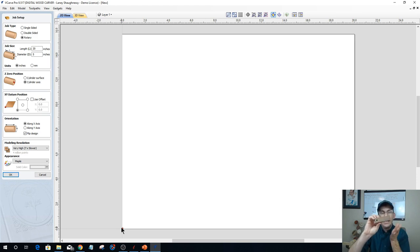the seam where the two halves come together, that's our bottom, that's our center line basically. Imagine if the top half of my whiteboard here was one seam and the bottom half was the other. When they come together, wrapping around this square blank, that's the flat, right? A lot of people think that they're zeroing out their XY on one of the corners of this blank, and they're not. They are zeroing out on the flat, when it unwraps.